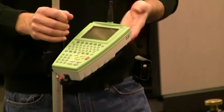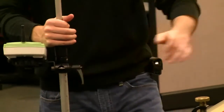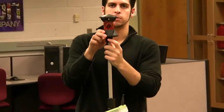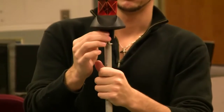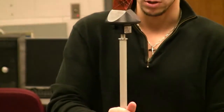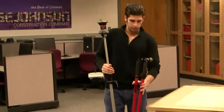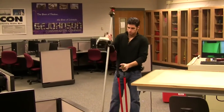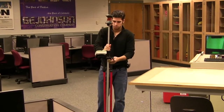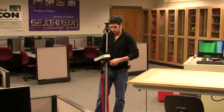This way the remote is secure and won't fall off if you bump it. Next, we have our prism — it sits on the top. There's a button at the bottom; push it and the prism will fall down, then release it. Make sure the prism is secure and doesn't fall off. You can also use bipod legs with this prism pole — basically it helps you stabilize, level, and plumb when you're shooting points. You can use them or not depending on your application.